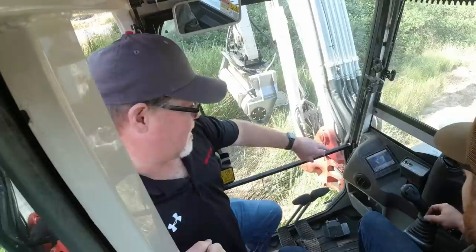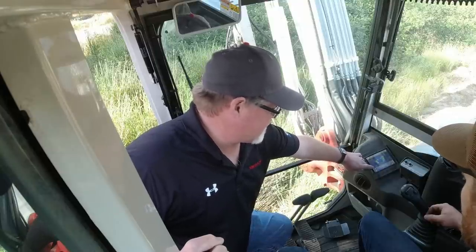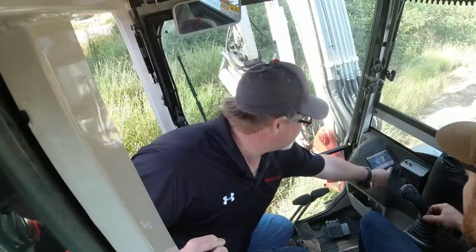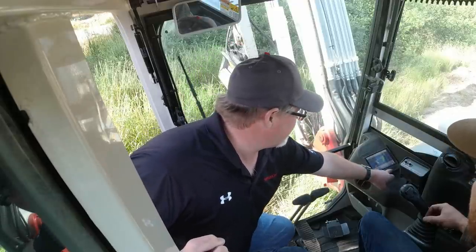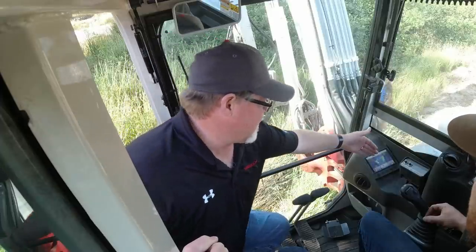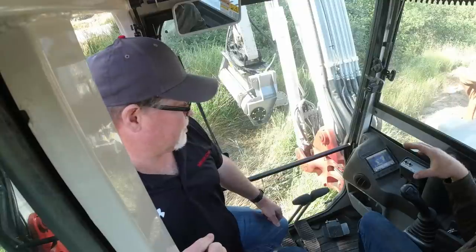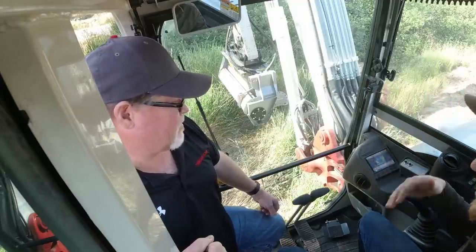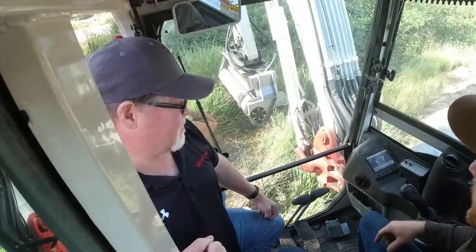So on the display, we can put three factory presets in for our auxiliary hydraulic flow. Right now we have it set for a cutter wheel. If you take the cutter wheel off and go to a grapple, you just switch your auxiliary function — it adjusts all the presets for the grapple. You can also set a third function, so you set your three main attachments with the flows for the parameters of each attachment. Like on the skid steer, I wanted to find the happy medium between good power to the head and still having track and boom functions when the head is bogging down.